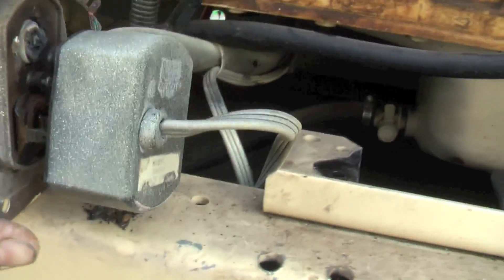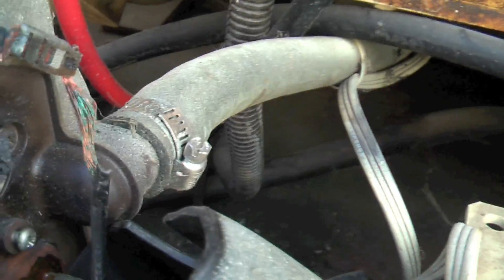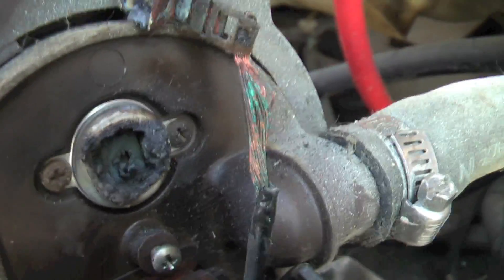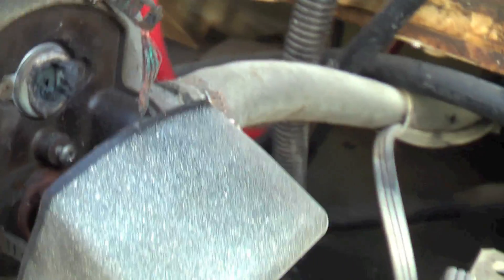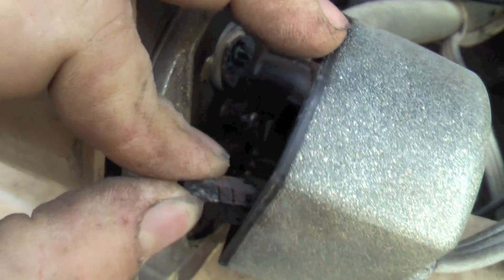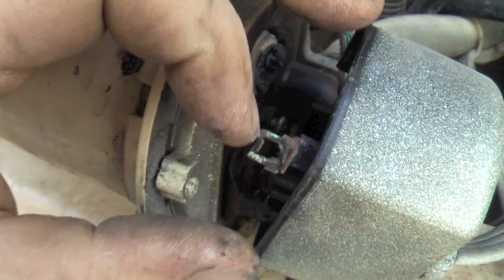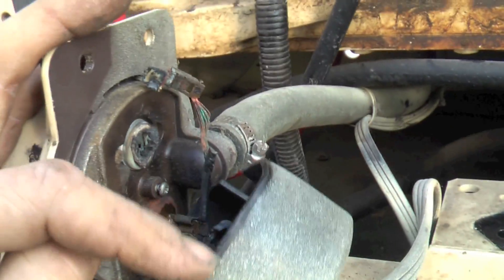While I was test running, I went ahead and pulled the block heater out to see why it wasn't working. And sure enough, I found some problems — underneath it we have some serious electrical issues. As you can see, that got really hot, it just started melting. There's one of the connectors, and this connector here was just hanging loose, which is why the heater didn't work at all. Don't worry, it's unplugged. Look at that — it's just crumbling. That's why it wasn't working. So I'm going to have to replace the heater, but that'll be in the next video.